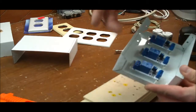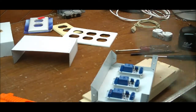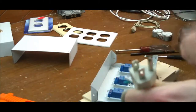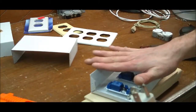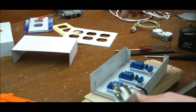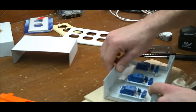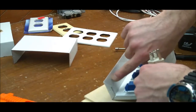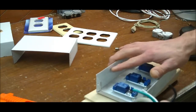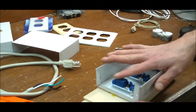What I'm going to do is put a plug on the back. I'm going to use this spare cord I had. The important thing is that it has a grounded plug, because this is a metal box — you want to make sure you get a good ground. If something happens and one of these shorts out, you have a nice grounded surface. What I'll actually do is grind away a little spot down to bare metal and run my ground wire to that grounding spot, then run a ground wire from there to each one of the plugs for a good ground connection.